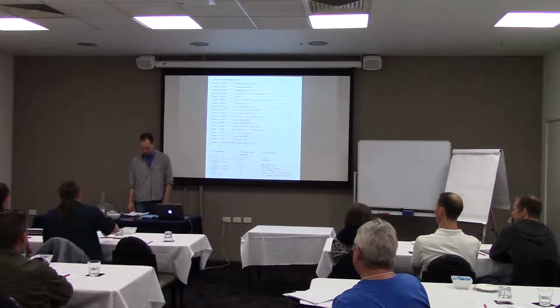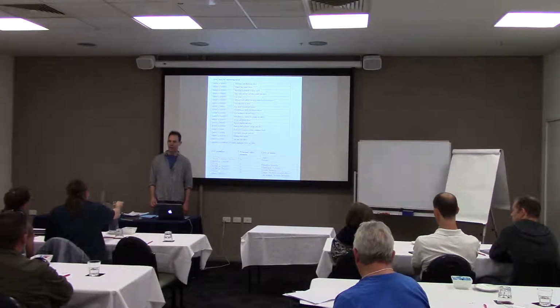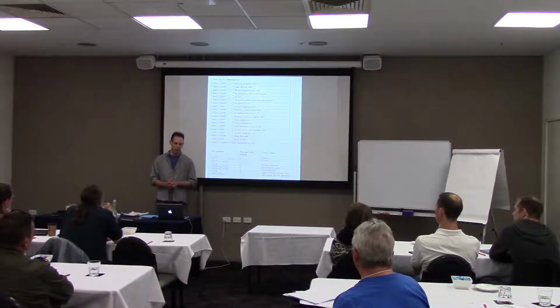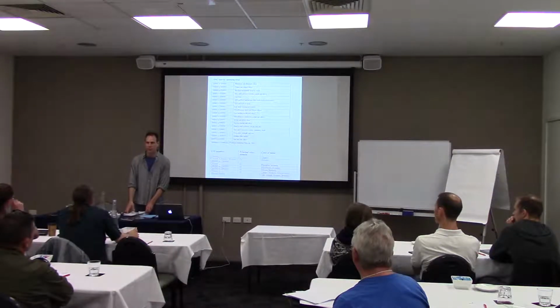Speaking of nickel, we've got Monel valves. I'm sure everybody's dealt with those. And that's 67% nickel added to it with some other elements. Originally Monel was created to keep seawater from decomposing metal and salt, so I think it was very useful in instruments for valves. I'm not sure what the Yamaloy version of that was, but that was their own kind of Monel, I guess. Any questions there? That's kind of self-explanatory.